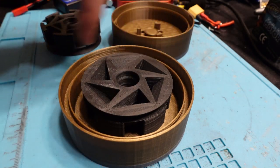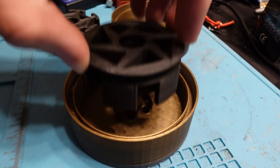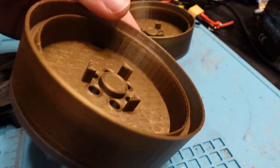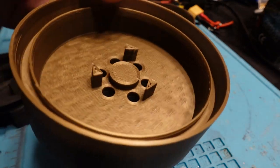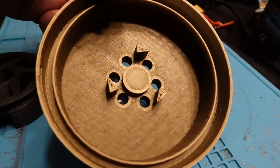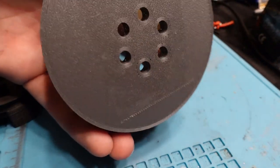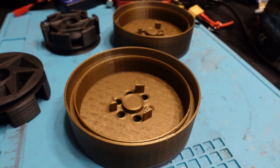I have about a two degree draft angle on the outside lip of the mold to make it so I can demold by pulling up without it sticking to the sides. I'm a little afraid that the 3D printed lines are going to grab it, but hopefully that'll help combat that. The mold is faceted since I didn't choose a high enough resolution when exporting the STL, so the wheels won't be perfect circles — they'll be like 50-sided polygons, but that shouldn't matter in practice once squished to the floor. I have holes at the bottom of the mold covered with packing tape so I can push from the bottom to demold the wheels more easily.